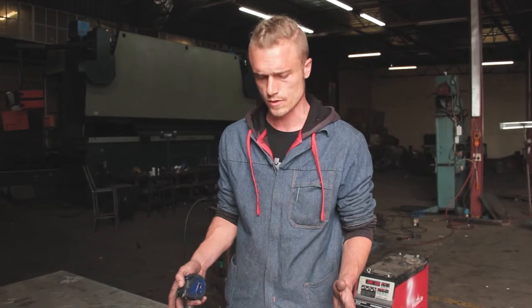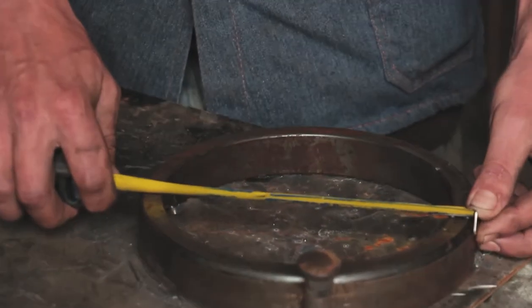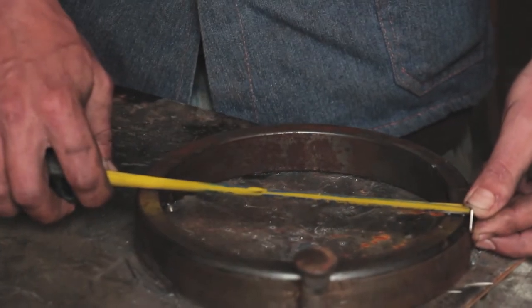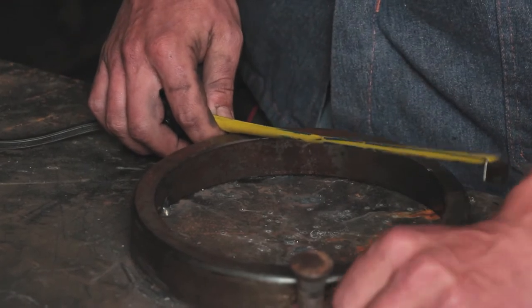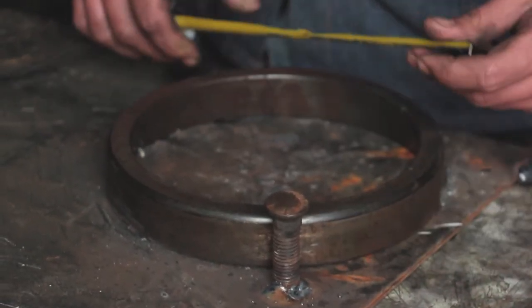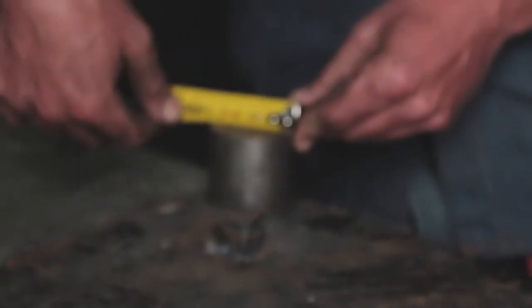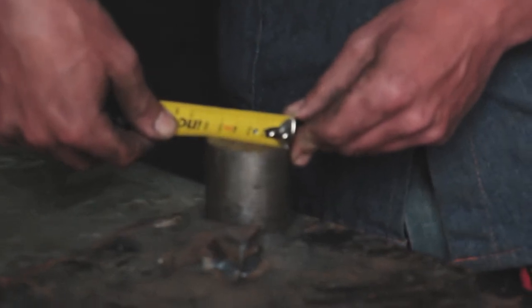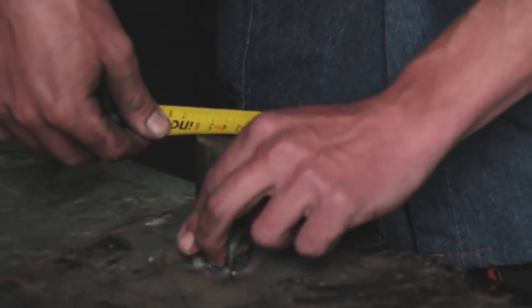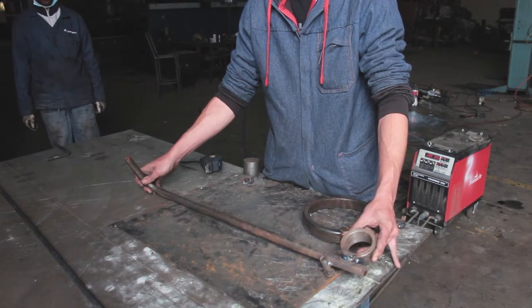It's Zoan from Flipping Nuts. I'm just going to take you through the jig we made here to bend your own shepherd's hook. Let me quickly show you — first, the diameter you're going to need is approximately 215mm, just a round piece with the stopper. There's a 12mm gap here so you can fit your round bar in. On this side you have a 55mm piece of solid bar, just with the stopper, and we bend our rod with that.